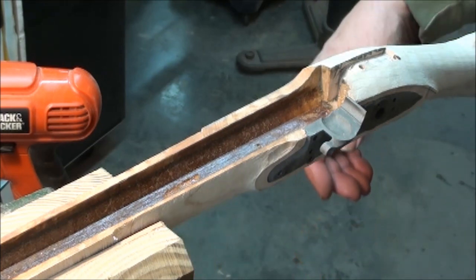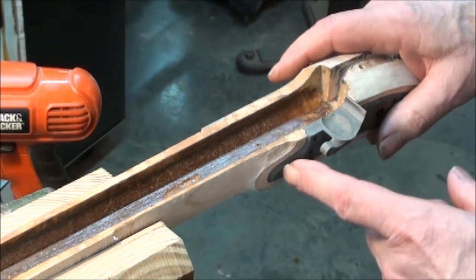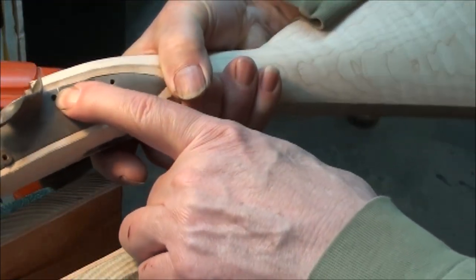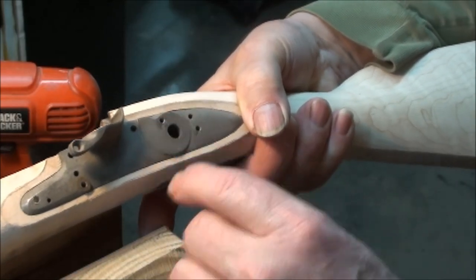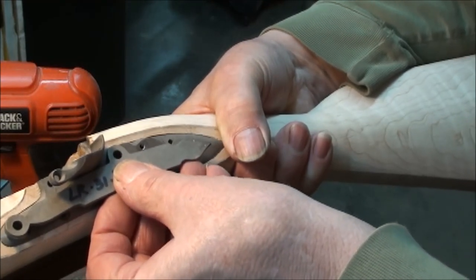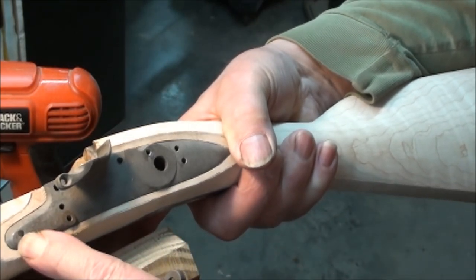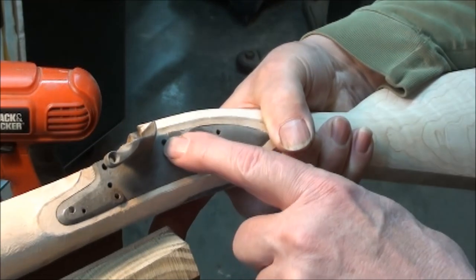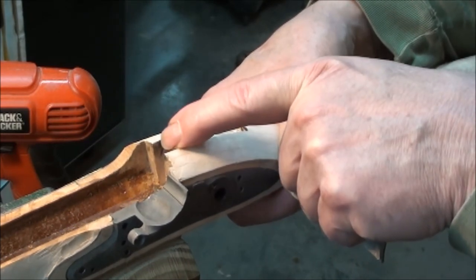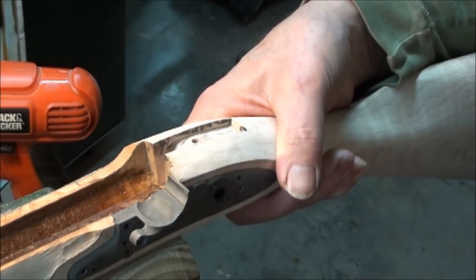Once you've figured out exactly where that is and you know it's okay to put your hole in right above that, you drill the holes for the plate. I've adjusted these two holes so they'll line up with the plate I'm going to be using. All I did was lay this plate on top, making sure I was forward of the mainspring and behind the breech plug. Now this hole will go through the web of the breech plug, but that's fine — as long as you're not into the breech of the barrel itself, you're okay.